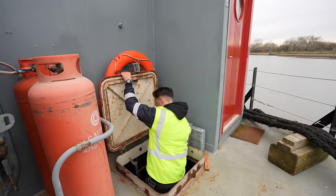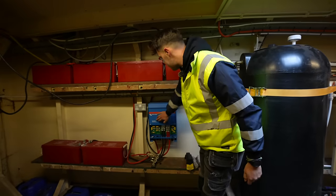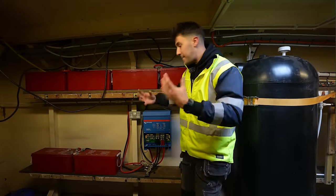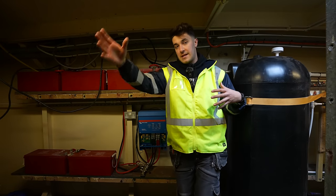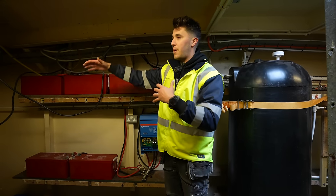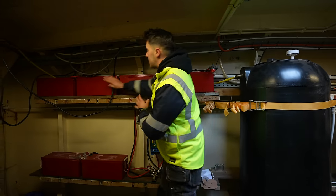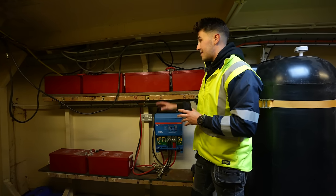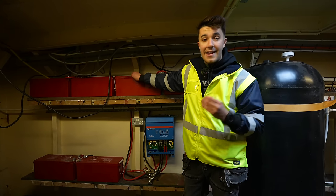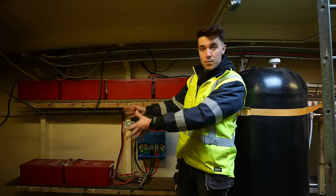Let me show you around the electrical system. The power comes in from the shoreline, out there, into this Quattro inverter, and then out and into the property. What this enables you to do is beef up that supply — if you've only got 16 amps, all of these batteries will basically top up that supply. However, even though you've got a ton of batteries here, these are lead acid batteries, and there's only actually 16 kilowatt hours of battery storage. When you do the maths on it being lead acid, you should never really deep cycle that, so in actuality you only have eight kilowatt hours of usable battery storage.